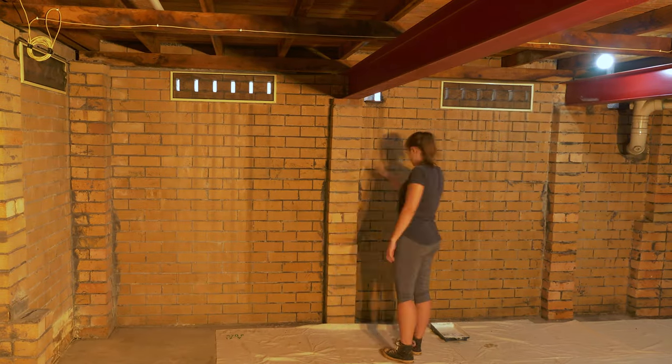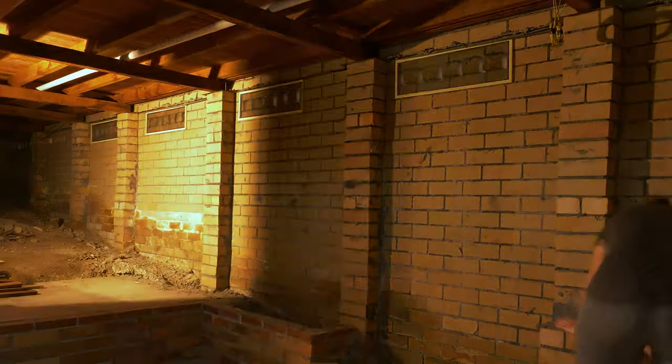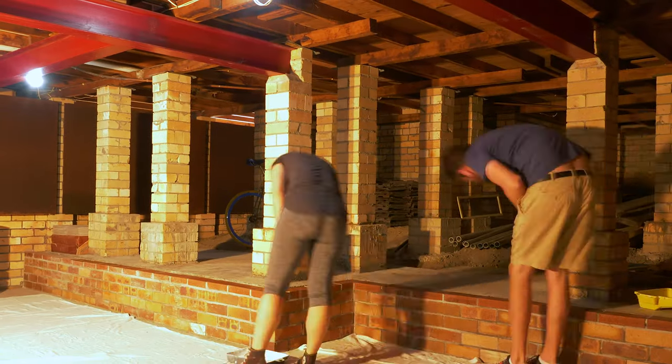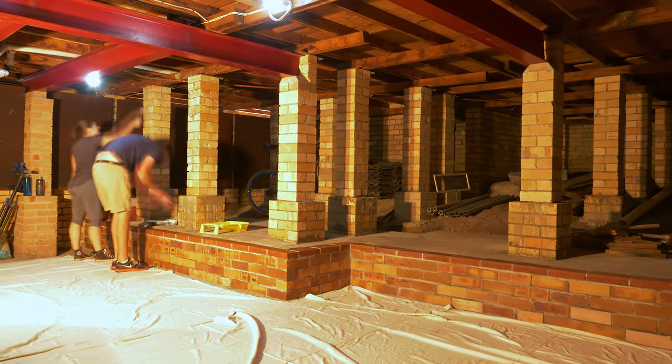So Boncrete is basically just like wood glue, so you want to be using old rollers for this. As you'll see later on, the Boncrete wasn't enough to stop the seepage on the bricks from the ground line, so we swapped to using a brushable waterproofer afterwards. So if you're at this stage, I'd recommend using the waterproofer as well as the Boncrete on those areas where there is ground behind the bricks.